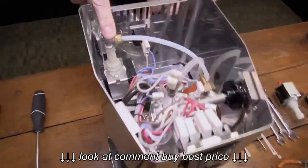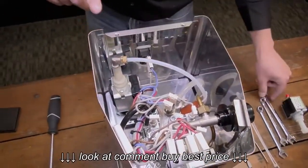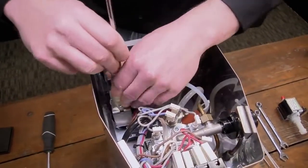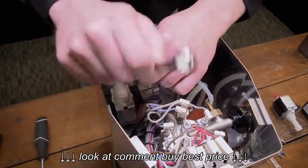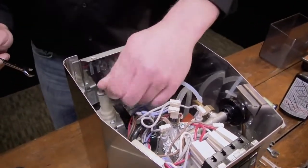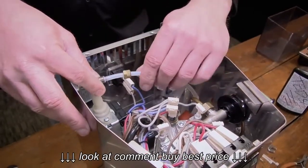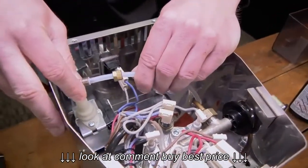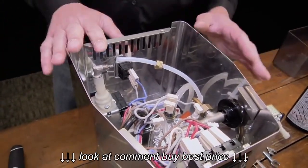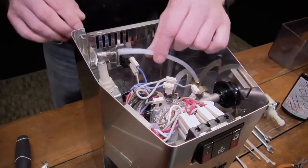Now the pump is right here. What we have to do is remove this line using the 12mm wrench. Go ahead and break that free — once you get it freed up enough, you'll be able to grab it with your fingers and just unscrew it. Once you get it off, you'll see there's a little flare and you just pull off the tube. Also make sure when you're doing this the machine is powered off and not hot, because it will be extremely warm in here.